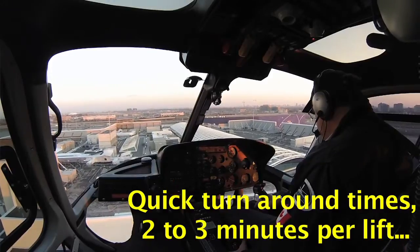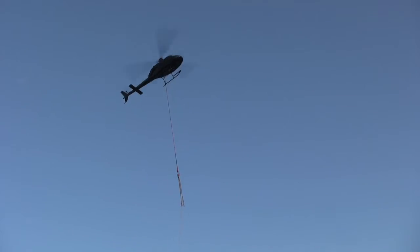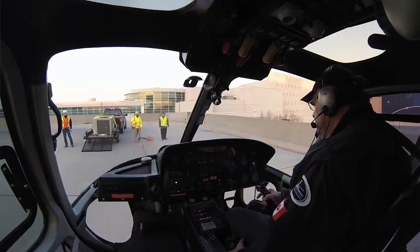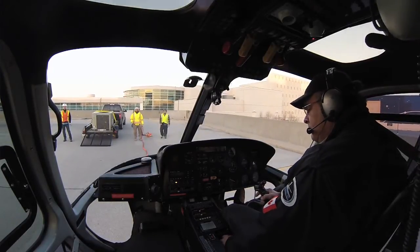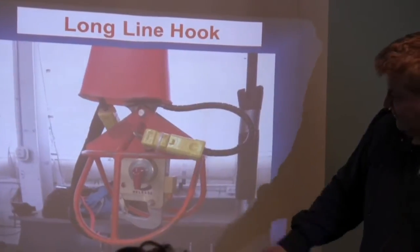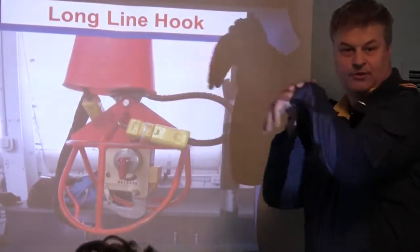Come down a bit more. Okay, just hold for a second. We're just going to do the shackles to make it easier. Okay, Dave, I see you. We're going to take all this rigging off the hook. Let me know when I can come under and disconnect. It's electrically connected — there's an electrical swivel in here. There's a manual release here. The manual release — you never put your hand above it. If it goes up, it will grab your wrist and snap it.